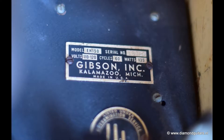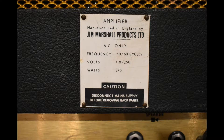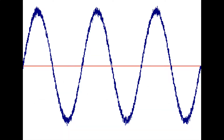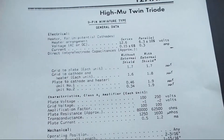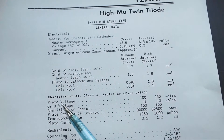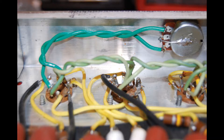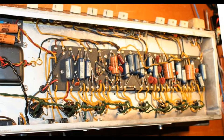Unfortunately, this is exactly how tubes might be operated inside some early amps that were built when the incoming AC was lower than it is now. And because the tube filament supply is almost always derived from a winding on the power transformer, it's subject to not only regular voltage variations, but also to power line surges and noise. The proximity of the various elements inside the tube can capacitively couple that power line noise to the signal path, and the last thing a tube amp needs is another noise source.